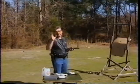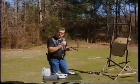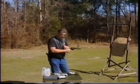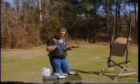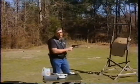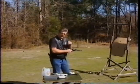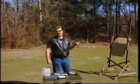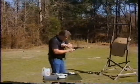Never, ever, never, if you have a single action, unless you are a pro and you have some special parts installed, never fan one of these guns like so, because yes, they will break. Even the Rugers, and I speak from experience because we ran an experiment some time ago just seeing how these guns could be shot, and yes, I broke a Ruger Super Blackhawk by fanning it. Got it where it wouldn't function. So any mechanical device, and these Rugers are about as strong and trouble-free as any firearm I've ever even heard of. But yes, indeed, we broke one by fanning it.